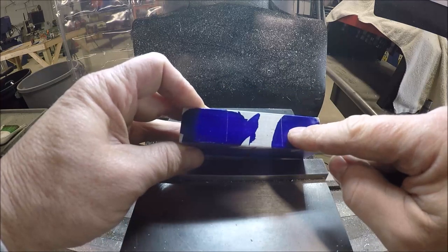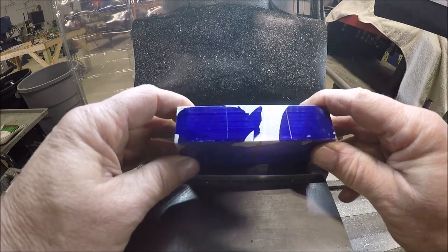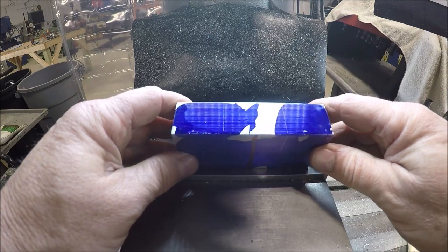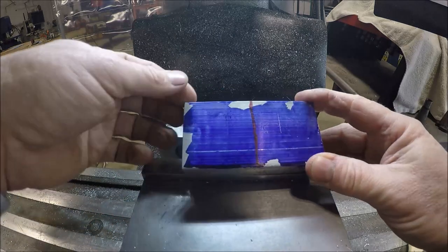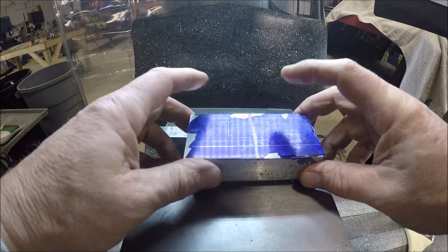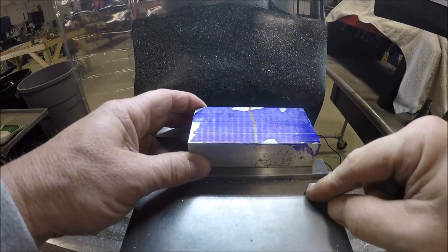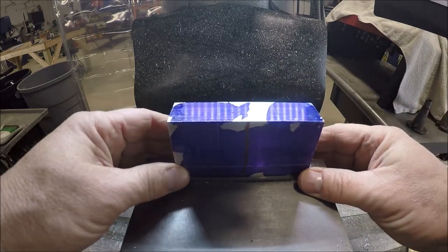These holes, there's no need for them to be precise because that steel over there doesn't measure perfectly. It's from 650 down to like 638. It's kind of egg shaped, so we'll make it fit. So that's the plan of attack. Let me get this in, find the edges, and we'll go ahead and do these two holes first. And then after that, I may drill halfway and then flip it around and drill the other half, or I can cut it and then just drill straight through. Not sure yet, but let's get started.